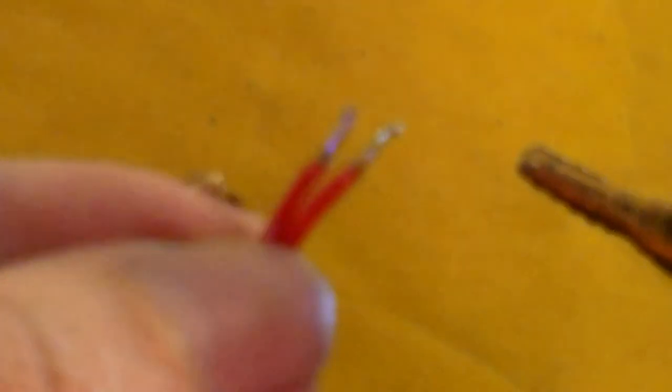I'm going to put my switch up here and tin the leads. Clean off the soldering iron, put a little bit of solder on the end, and touch it to the lead — it goes right on there. The lead is already tinned with something, so that worked out great. Now I'm going to take these two wires. The tinned part is kind of long so I'm going to cut them a little bit shorter, about three millimeters or an eighth of an inch. Then I'll turn the switch so its butt is facing towards us.